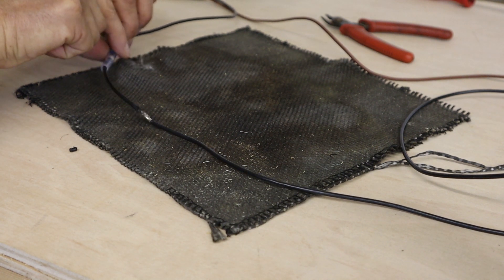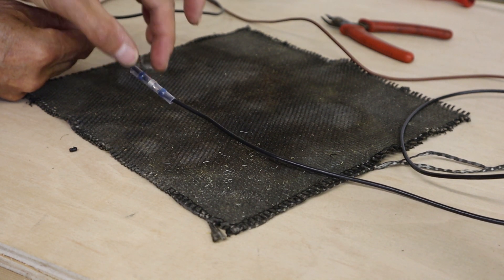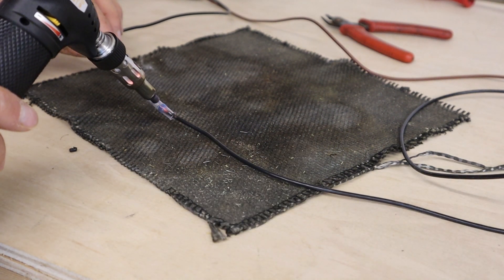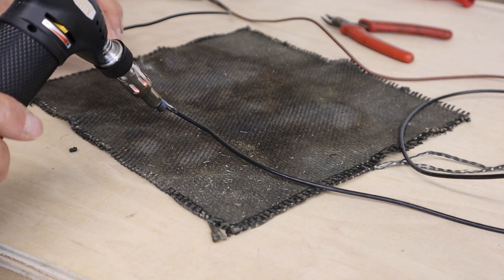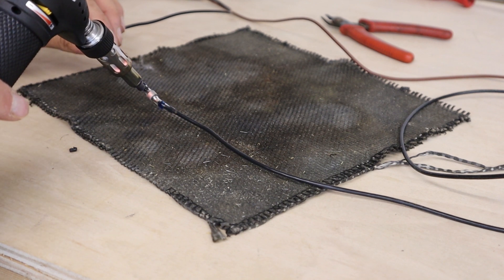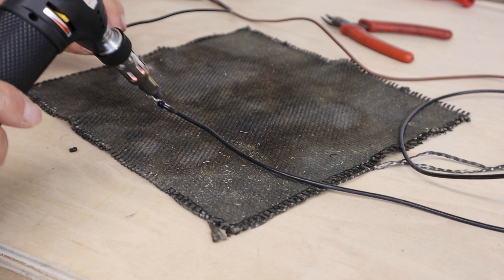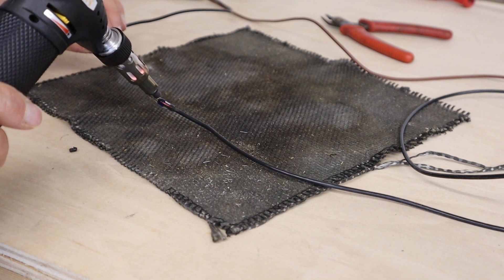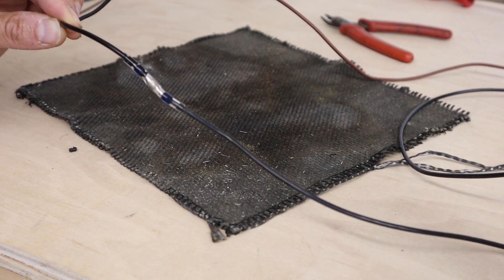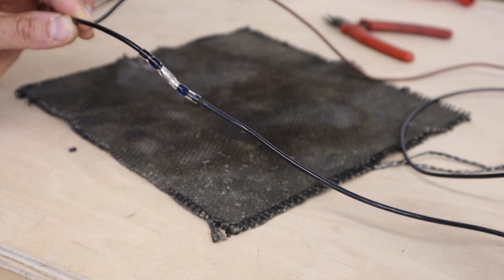Now I'm going to bring the solder butt connector over the top, lining up the ring of solder with our pre-soldered joint. Apply some heat uniformly over the whole thing, getting the glue sealing bits as well as the solder ring in the middle — you can see the solder ring just melting now. Everything's contracted nice and tight, and there we have the finished joint, all nicely shrunk, sealed and soldered.